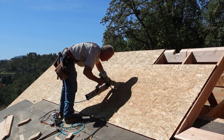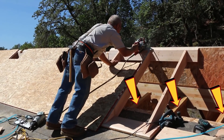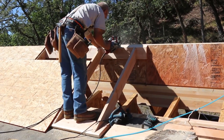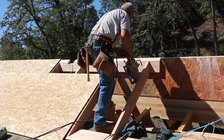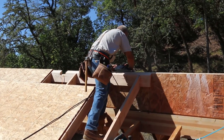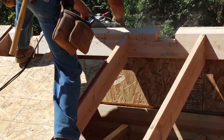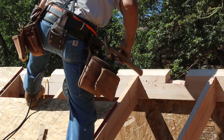You can see that the rafters on the shed dormer extend further past the beam they bear on than they have to — quite a bit. What that does is create a situation where, even though I didn't need to sheet this portion of the roof since it's going to be underneath the new pitch, having this extra length is making my life a lot easier by providing a working surface. I can just terminate this new little pitch right flat on the existing sheathing and get the job done much quicker, not to mention safer. I'm probably 18 feet above the decking on the second floor and 30 feet above the ground right now.